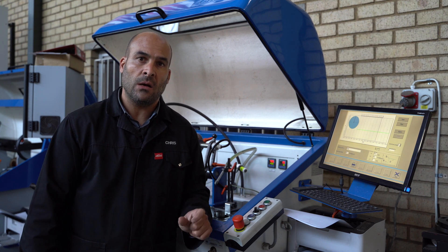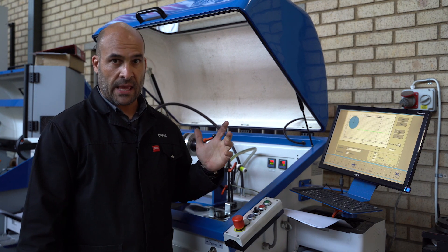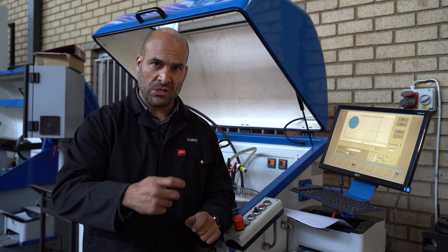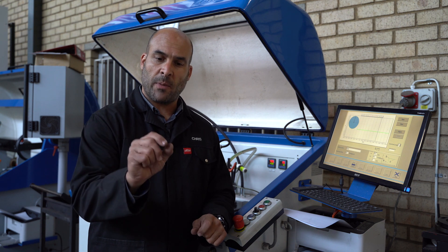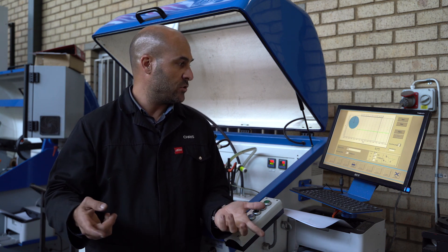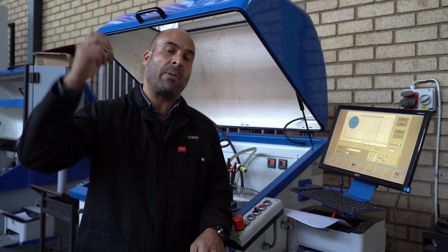We're sitting in front of the VSR. I've loaded a rotating assembly onto the VSR and I'm going to show you where I've loosened the shaft nut — there's about a three to four millimeter gap where the shaft nut is unscrewed, clearly visible to the eye. I'm going to close the VSR, do a run, probably get to about 80,000–100,000 RPM, then open up and remove the shroud to see what we find.